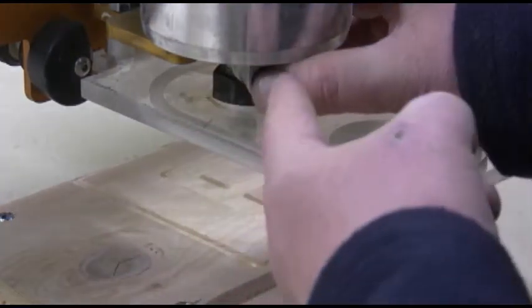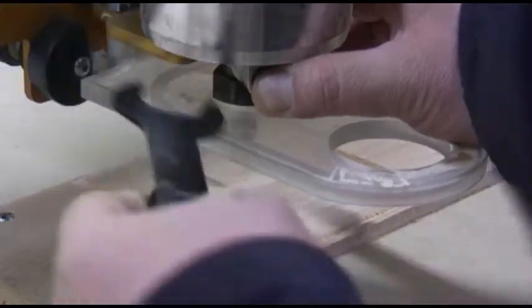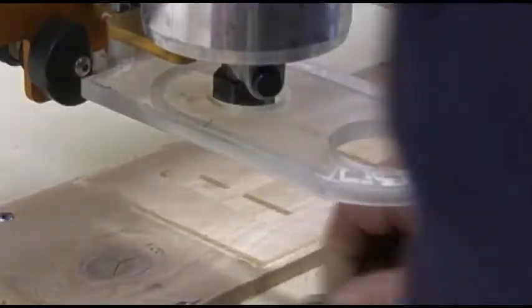Now we spin the thing around until the button engages. We can push the button all the way in. You have to have the button all the way in or else you can't change the bit. And then we just grab it with the spanner and turn it. I loosen it once and spin it around a couple times with my finger. It's faster than doing it with the spanner. Okay.